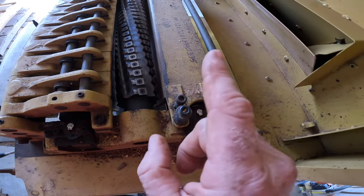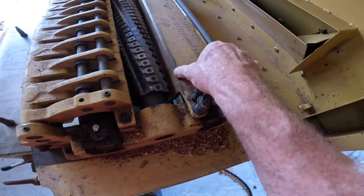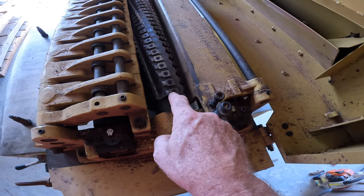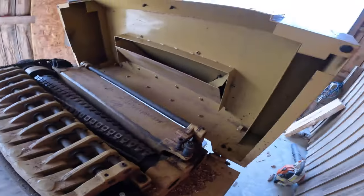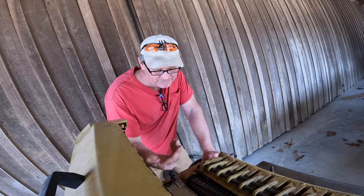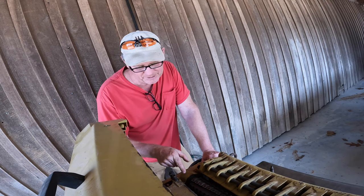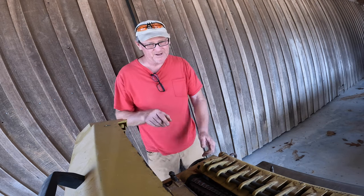However, a machine like this has this pressure bar, and it's adjusted so that it never touches the board while it's being planed. It's about one thickness of a coat of paint above the cutter heads. The board tries to flip up when it leaves, but it's going to hit the top of the pressure bar. That keeps it from gouging into the cutter, and it reduces the snipe.